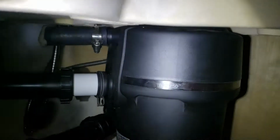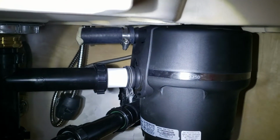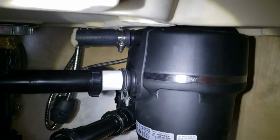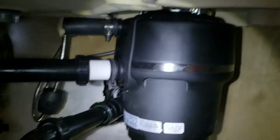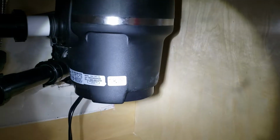The reason why is if you were to fill this sink up for some reason, or you had a lot of water, or you turn it on and a lot of water in there, it'll spit water out that hole and drip in your cabinet and ruin the bottom of your cabinet here. So just keep an eye on that until you get your dishwasher hooked up. Just be mindful. Don't get too much going on in there or any standing water in there. But right now the disposal is online and working. We tested it out. It's functional.